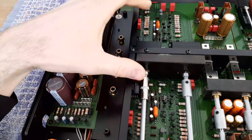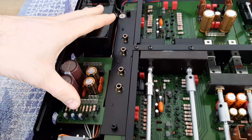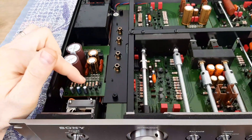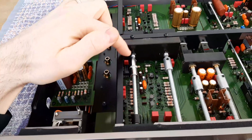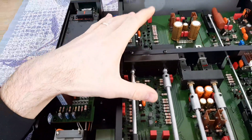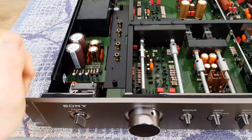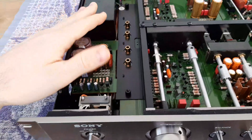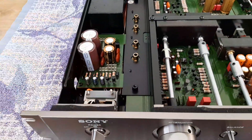This section handles the muting. When you energize the power amplifier, these capacitors here start charging. In a couple of seconds you'll have the connection between the output and the preamplifier. When you switch the amplifier back off, immediately the relays are disconnected. So here is the main power supply with the muting section — not protection, but muting.